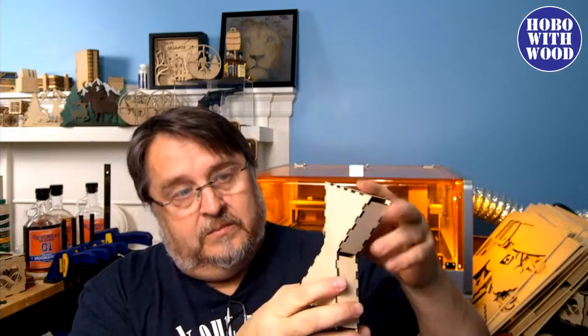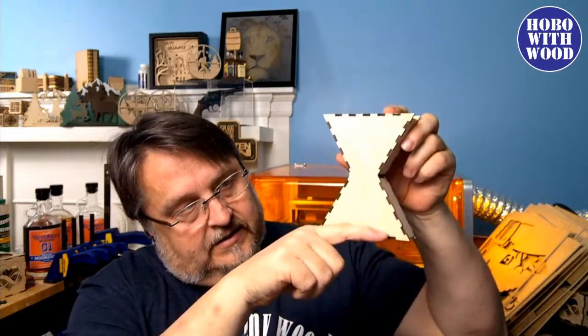So that's what I've learned this week. Pre-focusing the laser 5 millimeters and then learning your laser's spot size, because 90% of them, if not 100% of them, are rectangular shaped laser beams. Learn which axis is the widest and whether the difference is great enough that it varies, because a little bit can make a lot of difference, especially when you start pre-focusing it and raising it up. Once you figure out which axis has the widest spot size, use that scan angle to do the engraving. That'll help make it a more uniform finished look, at least from my experience and what I've seen.